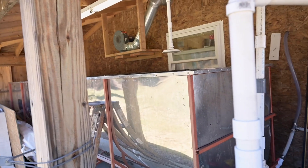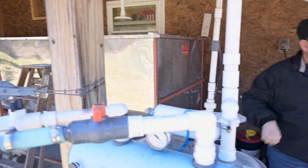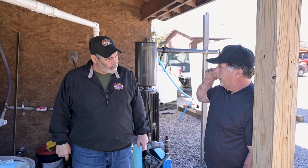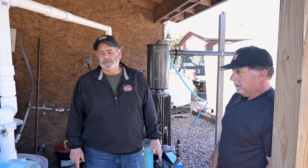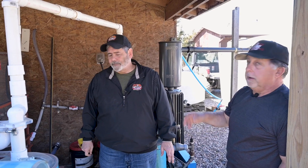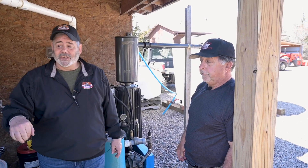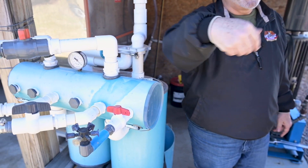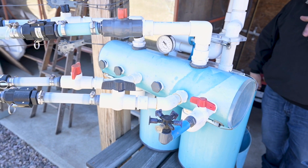Not all your taps are right here — you've got 1,100 on vacuum here, another 126 on gravity on your property, and another 240 in North Hero. You truck some of it here and put it through the pump into the filter and then into the sugar house. He's got multiple lines coming in, so if there are leaks in the woods he can figure out which section by turning the valves open or closed.